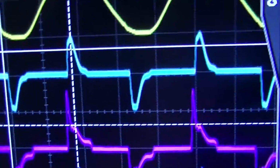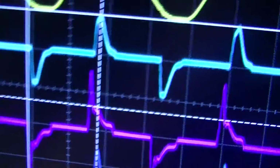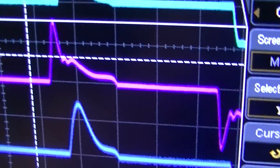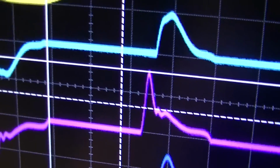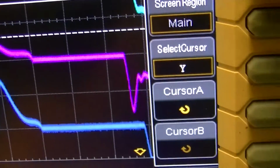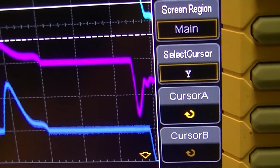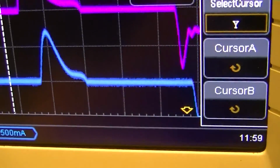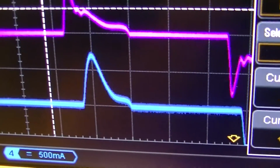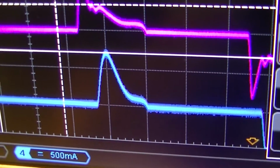Anyways, as you can see from this, the current looks to be in the range of about 490 milliamperes peak for the Dutch one, or for the Philips. The one that's from Sylvania is 680 milliamperes peak. Yeah, 770 milliamperes, and for channel 4, which is the Osram one, that is 710 milliamperes.